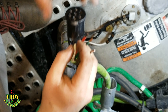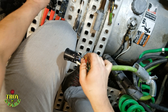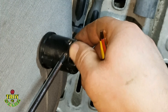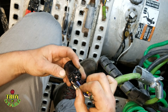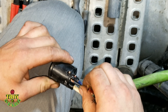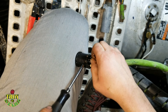You got two wires started out there — white, blue — and we're just going to work our way around. If you're not careful and you're not paying attention and you put the wrong color, you're going to have an issue: right when you go left and left when you go right. Maybe when you hit the brakes, a trailer light is going to come on on the roof. So pay attention to what you're doing. Get a flashlight out and do what you can — maybe do it under a light as best you can. Or just pay someone and let them suffer. That's the whole point of doing this yourself — not to pay the man.